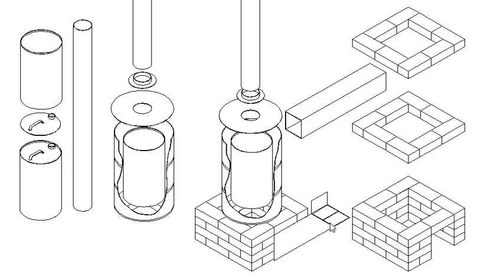This doesn't need to be metal and it would be better if it was made out of brick. When you're doing things like this, if you can get enough cut steel pipe it's much easier to set it up, and then you might want to put another flue in or modify it, so it's quite easy to build. When you're setting this into the ground you can set blockwork all around it and sit half bricks underneath as well to support it, which once up to temperature would help retain that heat. Once there's a big fire going that would be much more efficient than the original system, because with this extended flue it's already going to be burning efficiently and burning hot right from the get-go.